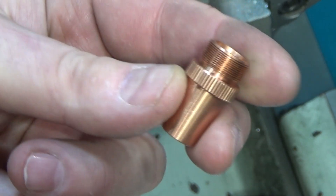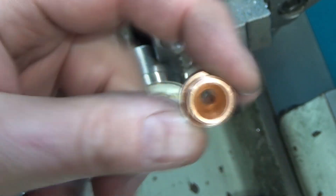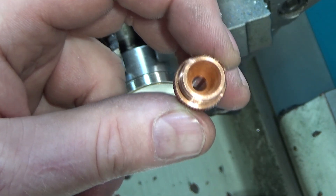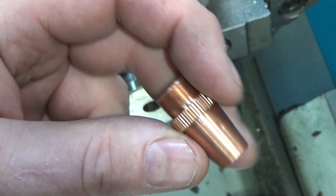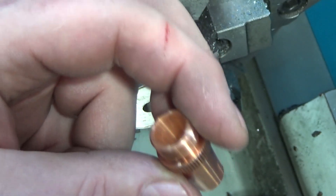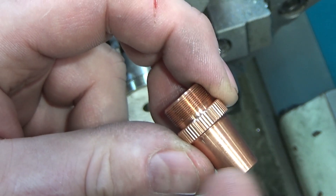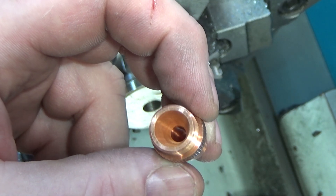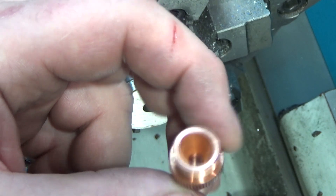Next up I want to make this part but slightly different. This is the nozzle for a laser welder - the laser goes right down the center and it's surrounded by whatever gas they're interested in: oxygen for some materials, inert gas for others. Their problem is they're not getting enough gas coverage out of this, so they want something with a much larger internal diameter. What they've been doing is removing this piece completely and using the gas from the galvo head, but spatter is getting up on internal threads and causing a problem.